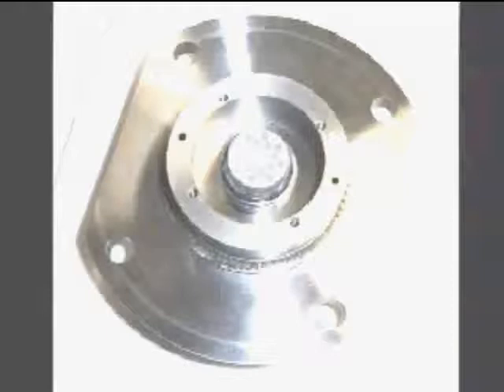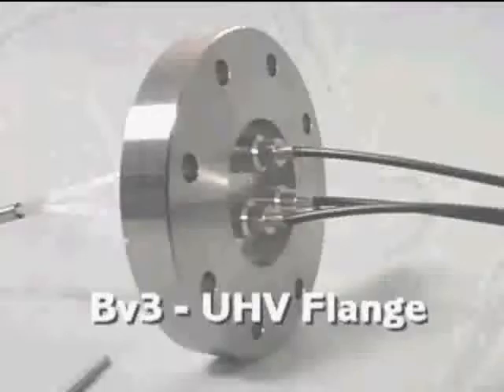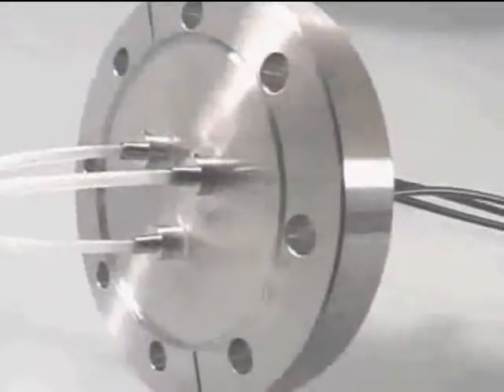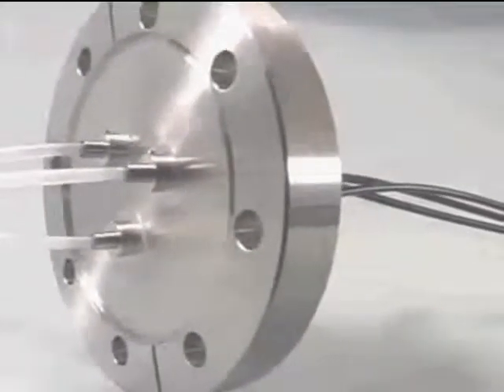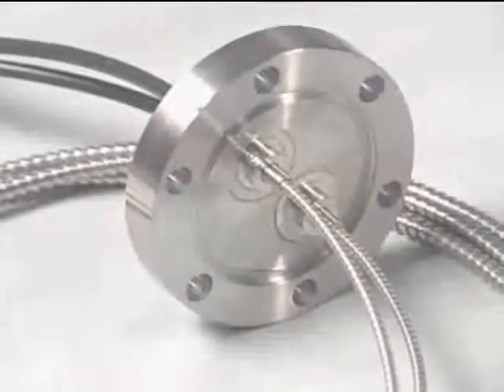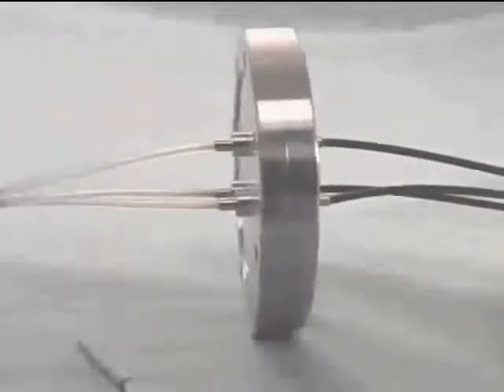Here we observe an eight-channel pass-through. For ultra-high vacuum levels, we recommend the UHV flanges — BV2 for D models or BV3 for RC models. These are single-channel pass-throughs comprised of a conflat flange of 304 stainless with bonded sapphire ports to maintain ultra-high vacuum. Just like the BVF option, the fiber optics are not fed through the flange; they are secured to ports on both sides of the pass-through.